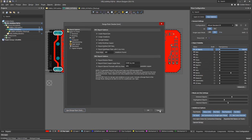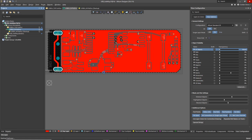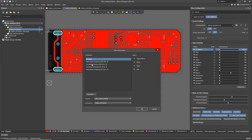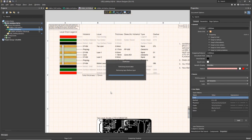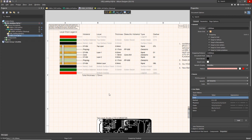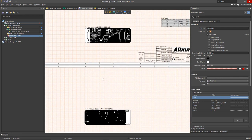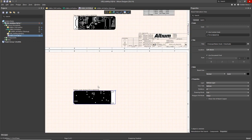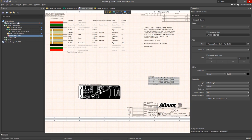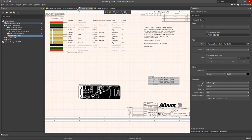We could run a design rule check, but I'm not going to run that — I know this is all done according to my rules interactively. The next thing you'll want to do is add some assembly and fabrication drawings to your design. I'm going to do that right now and pull also from a template. You can start these from scratch but I'm using a template because I like to keep the same standard set of drawings that the fabricators I work with want to see. The fab drawing has been created and it's automatically pulled in the different layer views, the layer stack table, any notes, and of course I can tweak and adjust those.